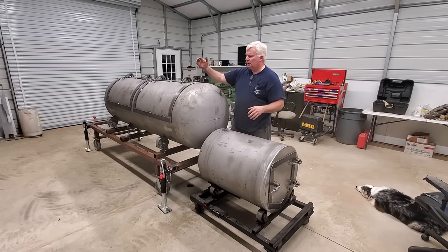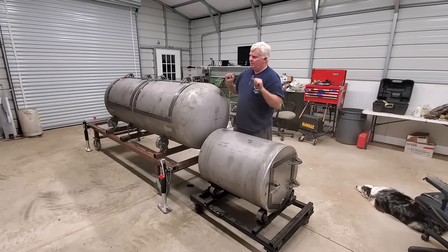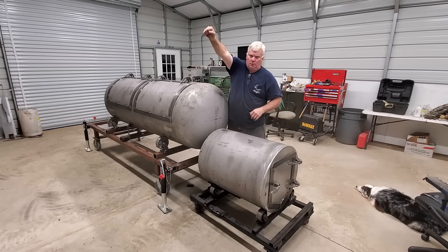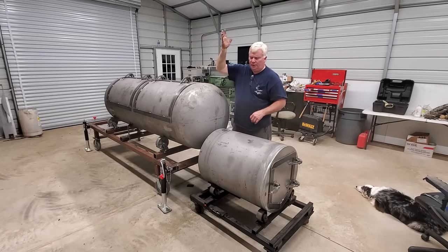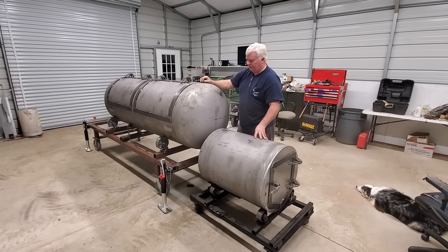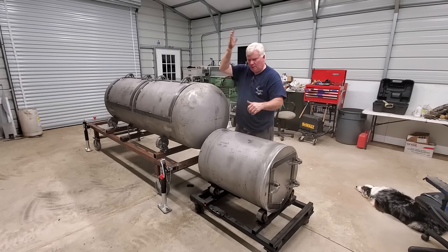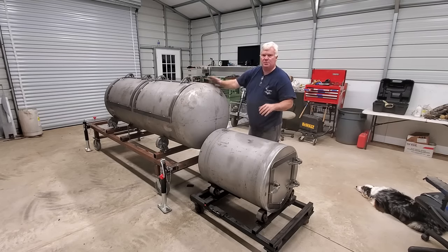and another important factor is how high your door sits. Because if you bring this firebox down to increase your distance here, then ground clearance is going to be an issue. The obvious answer to that is raise the whole unit up. Well, then the door gets so high that it gets dangerous trying to put the door up against the door stops up there. You're liable not to get it completely against the stop, and it could come back and hit you. I speak from experience there, operating a cooker that was just too darn tall, too tall for me, and I'm right at 6 foot. It was a very tall cooker. I thought that I had gotten the door all the way up. In fact, I hadn't. I started messing with the grate, and the door came down and hit me in the head. Luckily it didn't do some serious damage, but that's a trade-off.